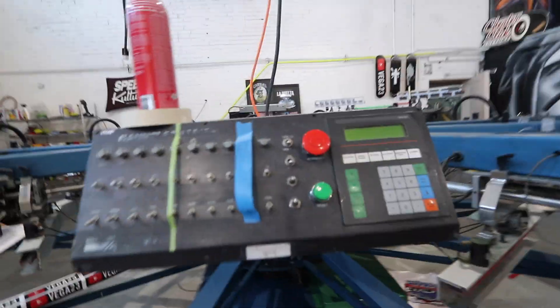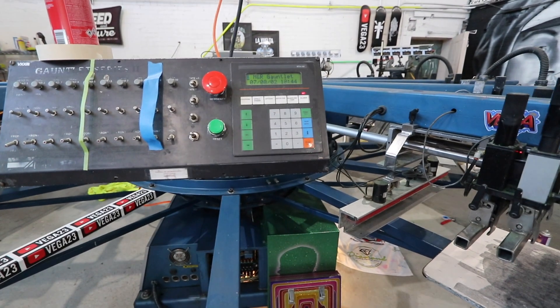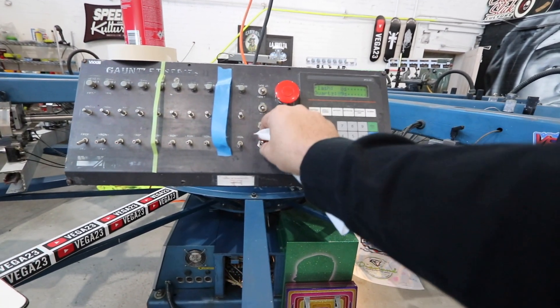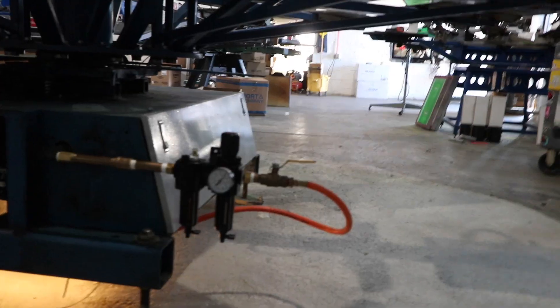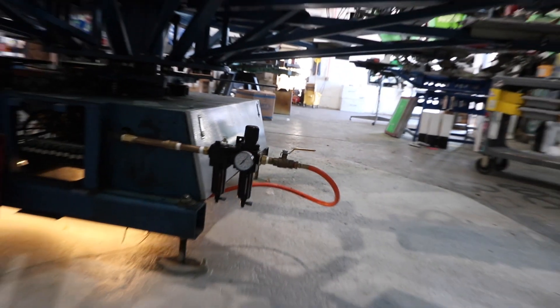Time to put it on. Now let's put some time — let's do nine seconds. Okay, right now like I said, with the carousel it spins and the pressure remains the same, no problem. We are at 110 — I know it's hard to see the needle — but there's a fluctuation of about within 5 PSI, maybe less, but that's just with the carousel. Alright, let's go turn on some heads.